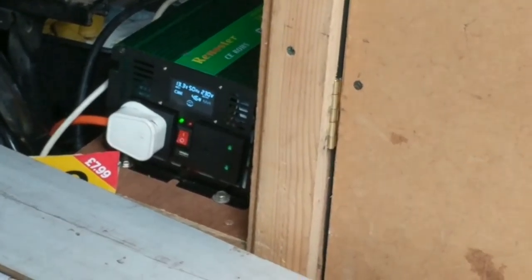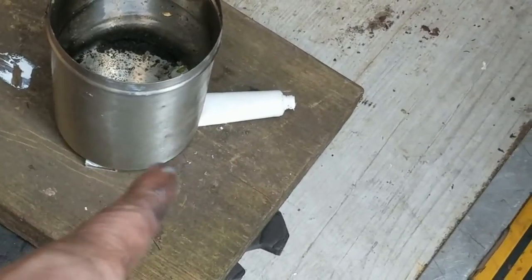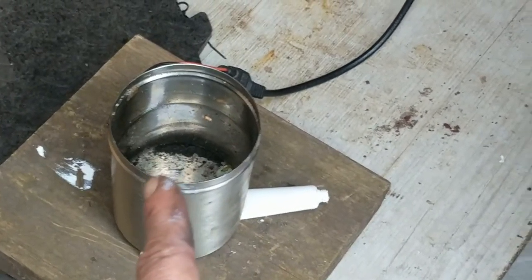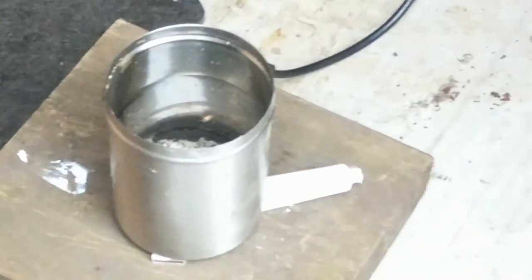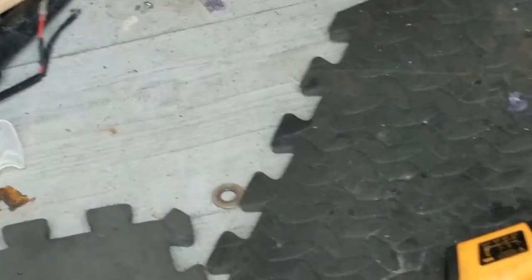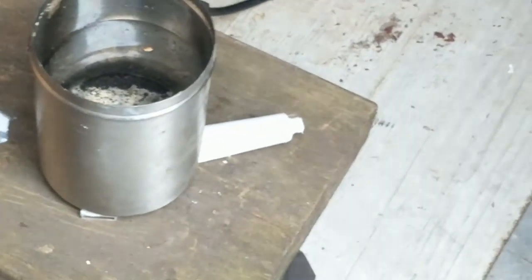We got to 69 watts, but it's gone back to 46 again. Maybe these aren't going to work after all. I've tried adding more goop under it and off-centering it to one side — not that I think that makes any difference. I just think it may be the convection of the water pulling heat out of it if it's more off to the side. If I'm only getting 70 watts, it's because I'm only taking 70 watts of heat out of it, so it's only having to put 70 watts of electricity back in to maintain a steady temperature. I need better thermal transfer into my water.